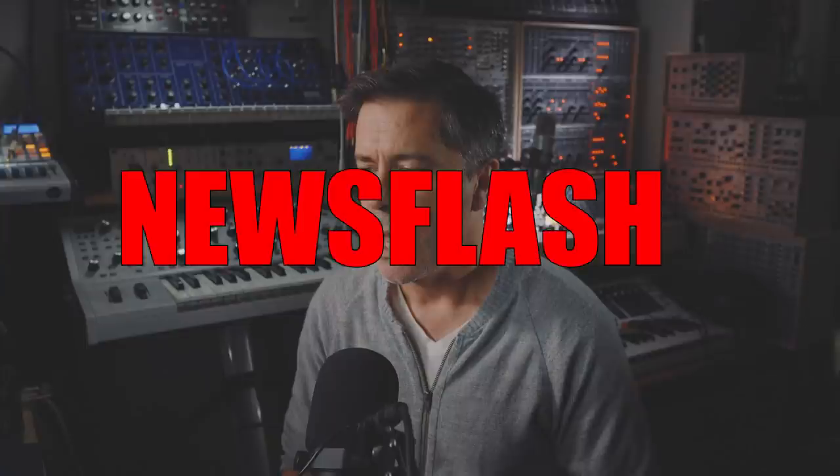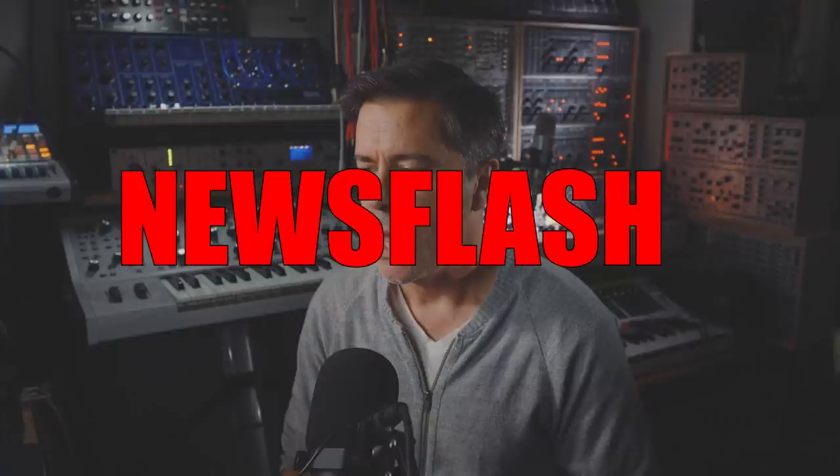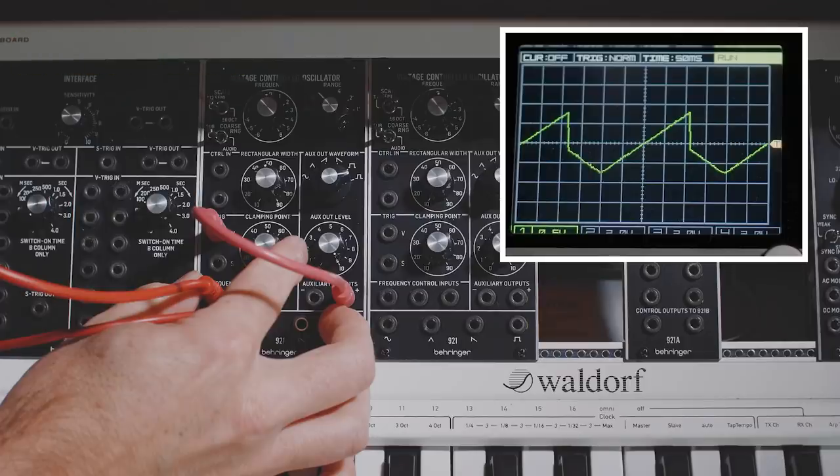Okay, so a bit of a news flash. I'd actually finished recording this video, but I've since found a way to fix the broken waveform issue with the 921 oscillators when they are in sub mode. Now, this is not a permanent fix. It's a fix that you have to do every time by patching it. I'm just showing you a screenshot here. You'll see there that there is a cable coming out of one of the aux outputs and going into its own trigger input, the V-trig input.